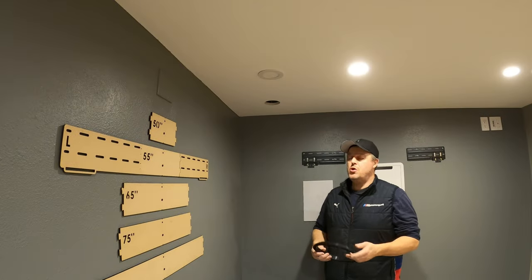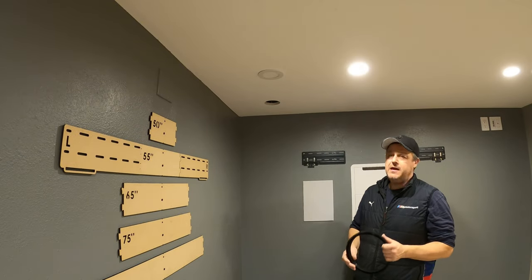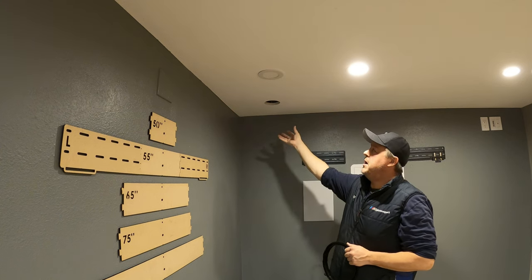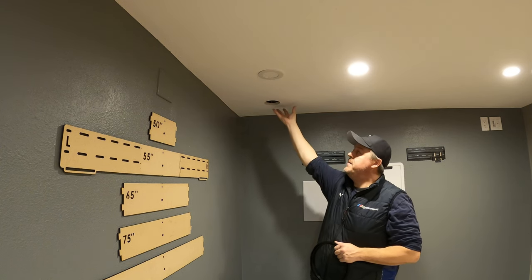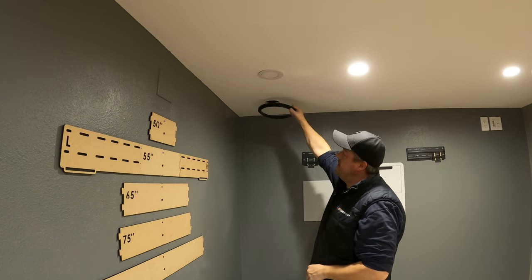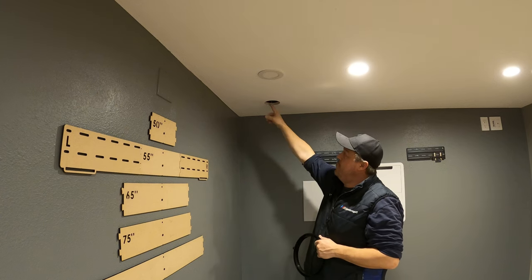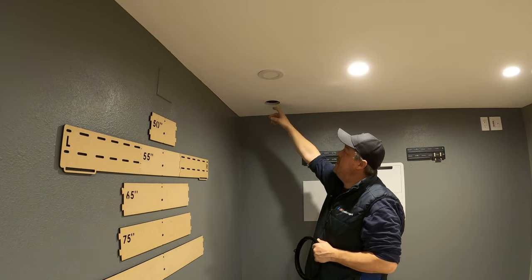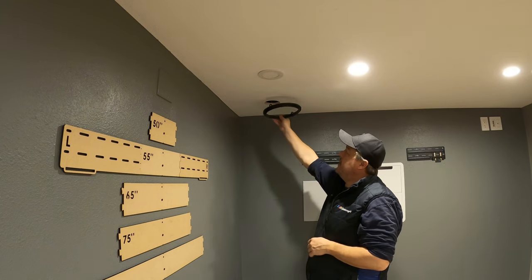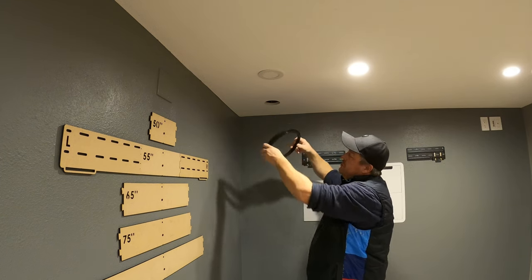Hey, Tyler from theater design company. Working on a couple of instructional videos today — basically got a customer in our demo room here, just kind of mocking it up, wanting to put a speaker in here. Ideally if you're a contractor, you're going to want to use a pre-construction ring so you don't have to worry about cutting this out. I did a four-inch hole saw here for a previous video, but you can imagine this is completely flush drywall and now we've got to cut this opening in.